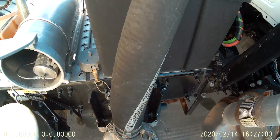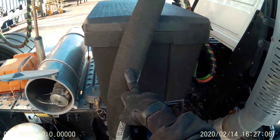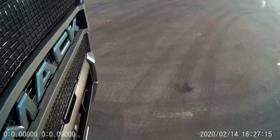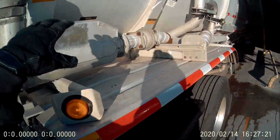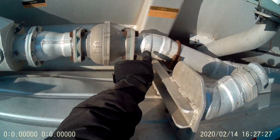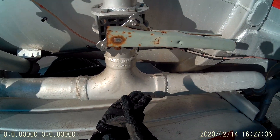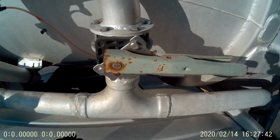It's basically like an air compressor with low air. We hook — it's called the hotline, and I'll explain in a minute why we call it the hotline. We hook our hotline to it; it connects to the trailer. It goes through a filter and there's a one-way valve so nothing can come back into the blower. At this point I can send air up to the top of the tank to pressurize it.